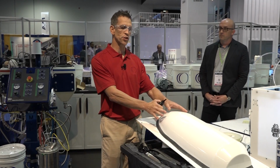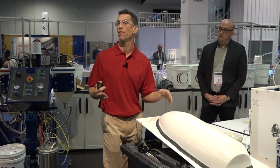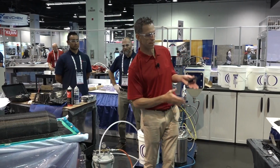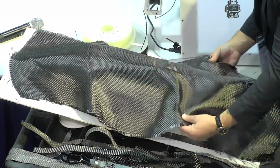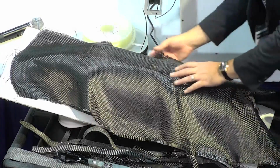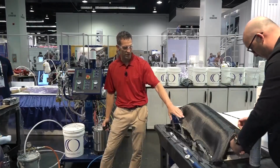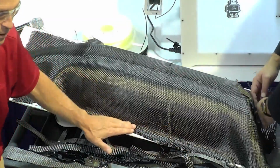This is just to show you the initial ply layup, what we'll call the face sheet layup. We're laying down strips of carbon. And now we've given you an overview of the face sheet, or again, the initial ply carbon layer on an example of our infusion layup. Travis is kind enough to finish up our 3K face sheet over my corner layup strips.